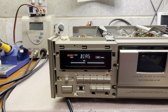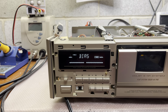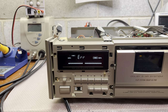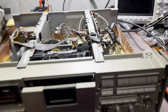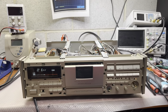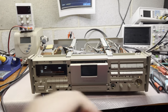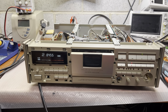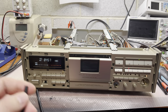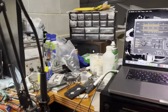Something gets really wrong. I see it tries to find, but it cannot. So probably output levels are wrong. You see, error. So looks like this output levels may be wrong. Let me check. Maybe this model is different from CT42. I may try to set level to zeros. And let's see. In my experience, it always gets level like 2 decibel lower than needed.